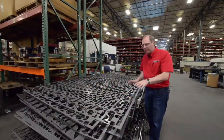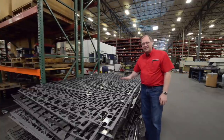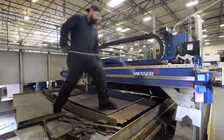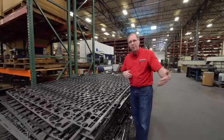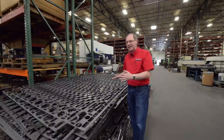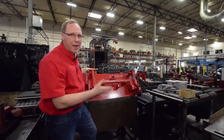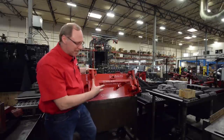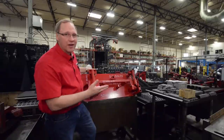This is a pile of scrap metal — what's left over after we plasma cut or laser cut steel parts. You'll notice there's very little waste, largely due to computer programming. Our laser tables are smart enough to find where the holes will be and where wasted patterns will be found. The computer recommends small parts to fill those holes and tells you the most efficient cutting pattern. You just tell it how many parts you want of what part number, and it generates the layout onto the sheet and fills in to maximize space.